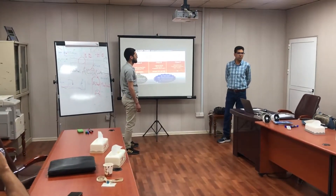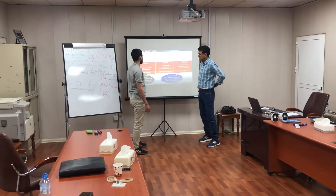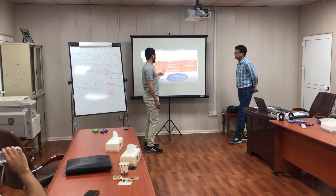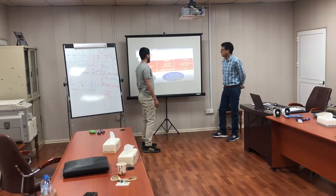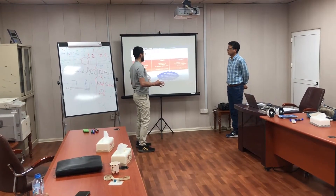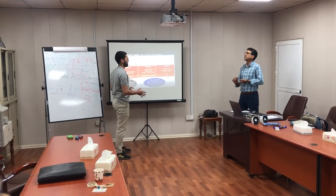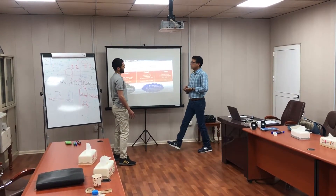We need to store it in a pressurized container, or maybe we have to cool it down. For the second class, the flash point is between 23 degrees centigrade to 65 degrees. The vapor pressure is lower, so we don't need to cool down as much as we do for the first class.